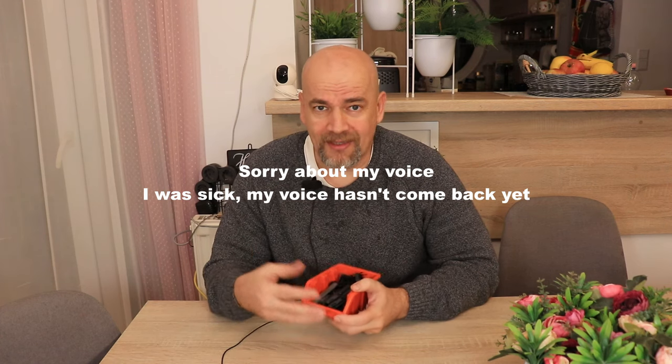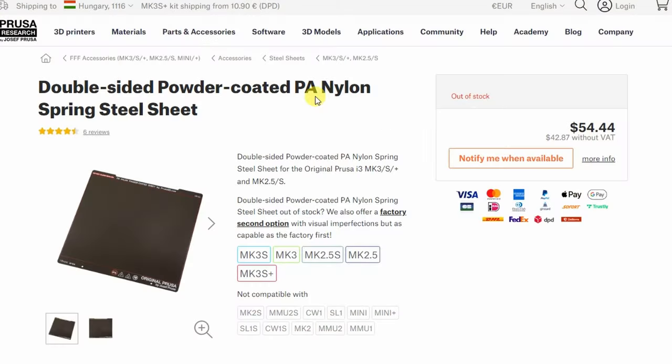On the conclusions: first of all I apologize for the long video, but this was huge work and it cannot be shorter. Maybe you didn't even notice there are no ads during the video. About the print sheet — I received from Prusa a print sheet specially designed for PA material, but it is too late for this video and will be tested in a future one. About printability: the warp-free technology works fantastic and these can be printed on an open printer. Of course pay attention that you need a harder nozzle, and I definitely recommend using a filament dryer. Immediately after printing, put it in a reservoir or vacuum bag with desiccant inside.